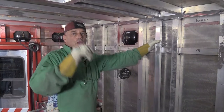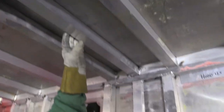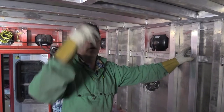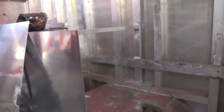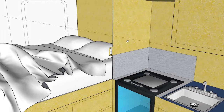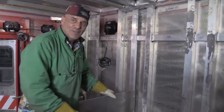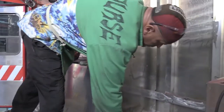We have all of the framing added in. I had put in additional framing up here. One problem you have to be careful with is when you're welding it up, you don't heat the outside skin too much and make it pull away. A lot of times you can't put the welds all the way up to the top because you just don't want to overheat it and pop the paint off the outside. This is going to be our bulkhead that goes down beside the bed — that vertical bulkhead — and the stove will be over here. We ordered another plate from Amazon that fits in just perfect. I've drilled some holes similar to what I did on the other plate. I like this concept — it punches it in real tight.